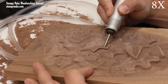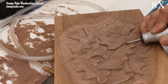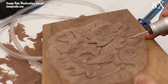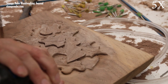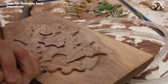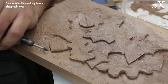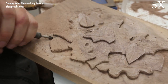Next comes my favorite step: undercutting. This thins out the edges of the leaves to make them more realistic and adds shadows to create the appearance of even more depth. I switch away from the carbide burrs for this because I need a sharper point — I'm cutting beneath the edge of each leaf, creating an overhang. I love how this seems to make them rise from the background. I'm a big fan of aggressive undercutting, which does get me in trouble sometimes because I may make something too thin and break it off, but that's what superglue is for. Be careful not to overheat the steel bit — if you're scorching your wood, you're dulling your bit, so back it off.